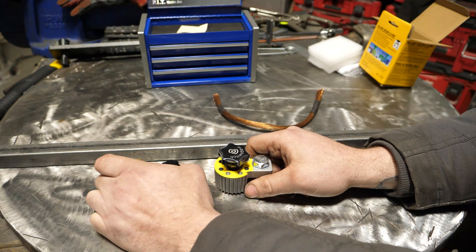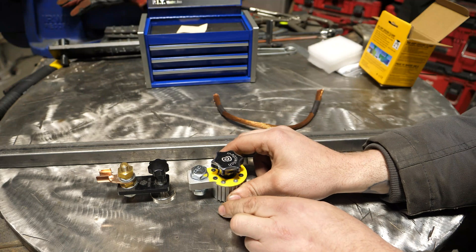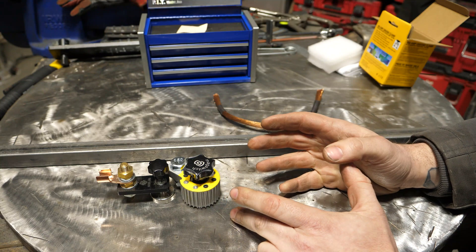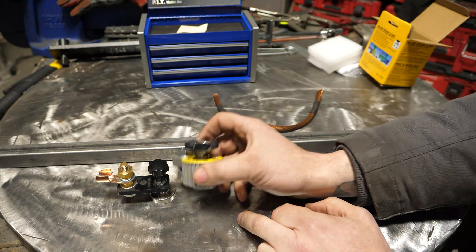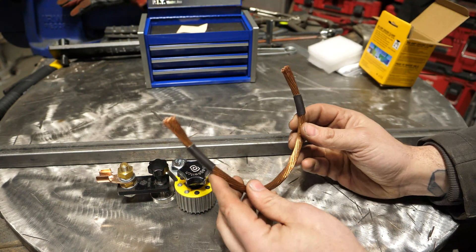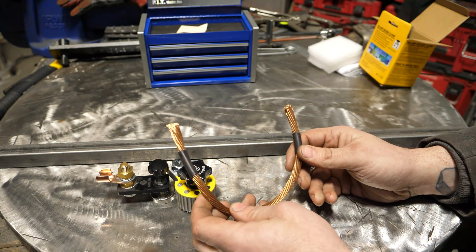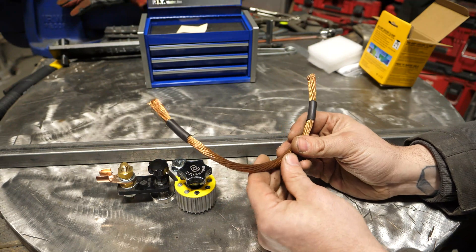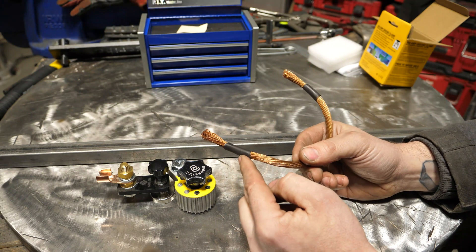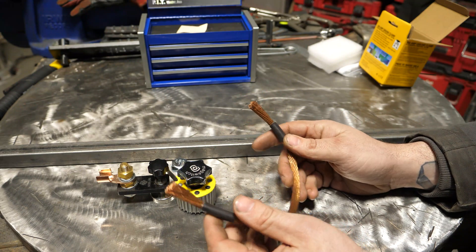These are really handy on repairs. The mag switch works very similarly — on and off — very handy to have. Now there's another way to ground on unconventional objects like round stuff, or where you can't use a magnet because the material is aluminum or stainless. That's where this little ground strap comes in. All it is is bare copper super-flexible wire, and I used heat shrink tubing with hot melt glue — marine tubing — to keep it from separating and falling apart.